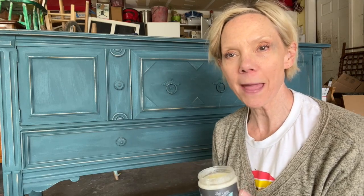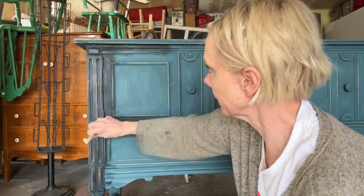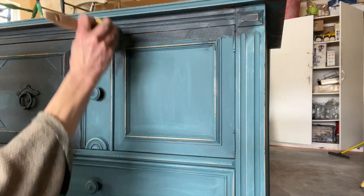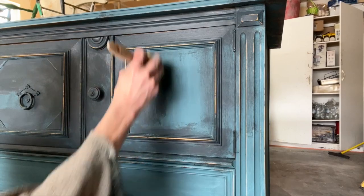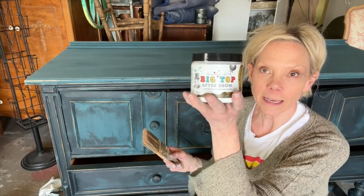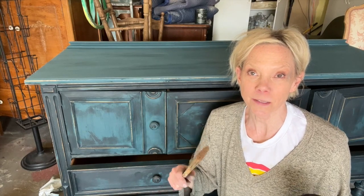I am going to really work the wax into the paint, and it will create a beautiful finish. I have a signature watertight finish for the top. DIY paint is so pigmented and is reactivated with liquid or moisture before you put a top coat on, so I always like to take out a little bit of wax, put it on a separate container, and really work it into the paint. It's going to look wet and in some places translucent again. I like to follow the natural lines, going up and down on flat places and in circles in other places. I want the top to be really solid — I like to do one to two coats of DIY Big Top. It is the toughest finish DIY paint makes, but then I want to add an extra layer of softness using the clear wax. Putting an oil base over a water base makes this watertight sealer. I will show you once the wax is hard and spill something on it, and you will be amazed.